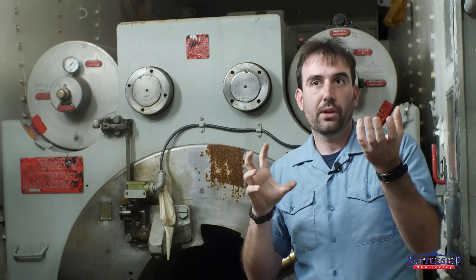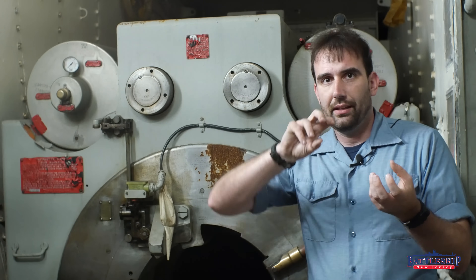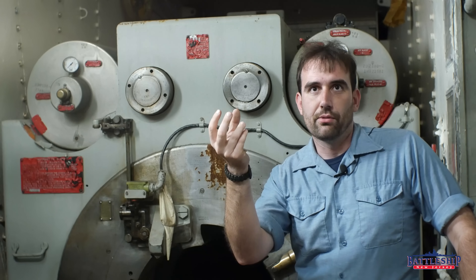With smaller projectiles — starting with the 12-pounder in English parlance, or the 3-inch in American parlance (76mm) — your brass base ring is actually encased in the shell casing, which has all your powder in it. So it's not until the combustion happens and the projectile is being ejected that it's going to grip the rifling. In some cases with smaller rounds like the .50 cal or the 20mm, they don't have a brass ring on them — the bullet itself is cut by the rifling as it goes through, it's a soft enough material. So for our smaller guns — the 20mm Oerlikon, the 40mm — you can extract a fully loaded round.